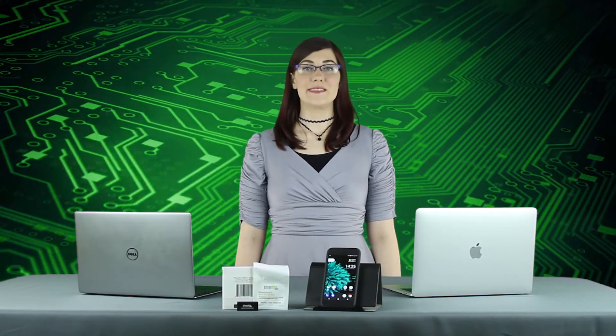The USB-C meter allows you to test for USB-C port spec compliance, such as a VBUS hot condition and voltage drop under load. If the meter turns on when only connected at one end, the attached device is VBUS hot, which is against USB-C specifications.